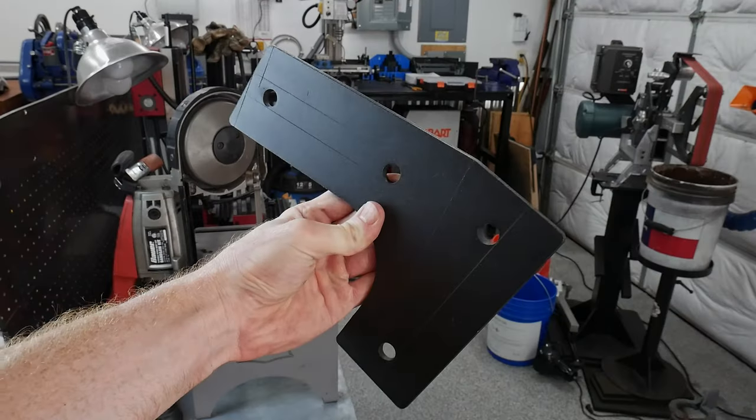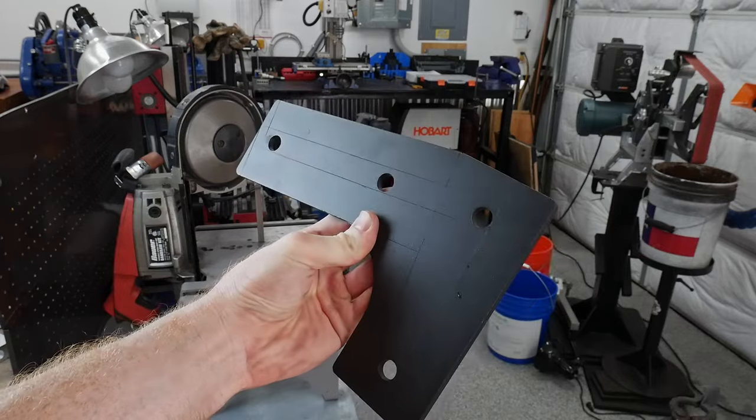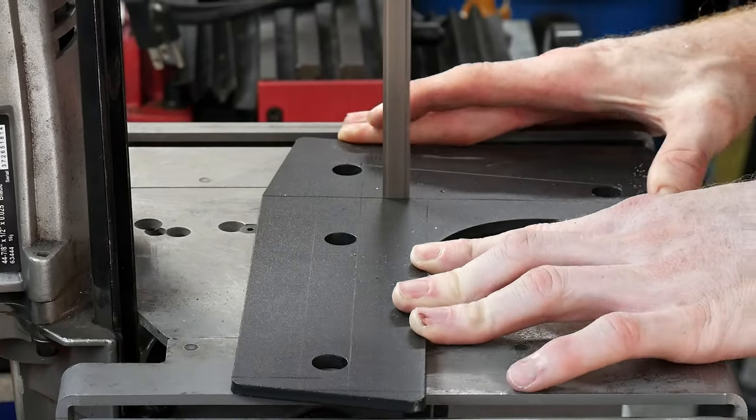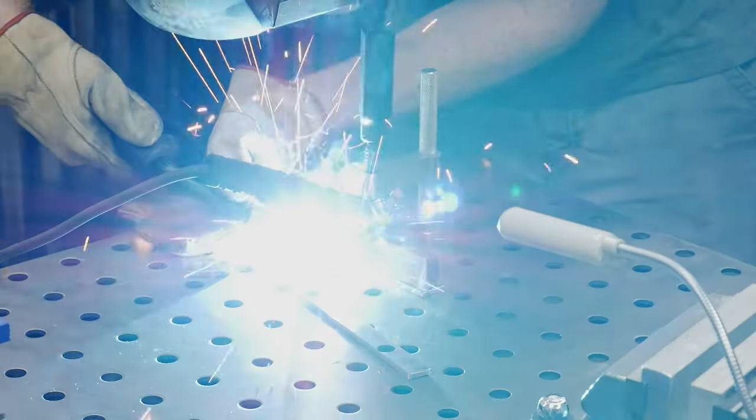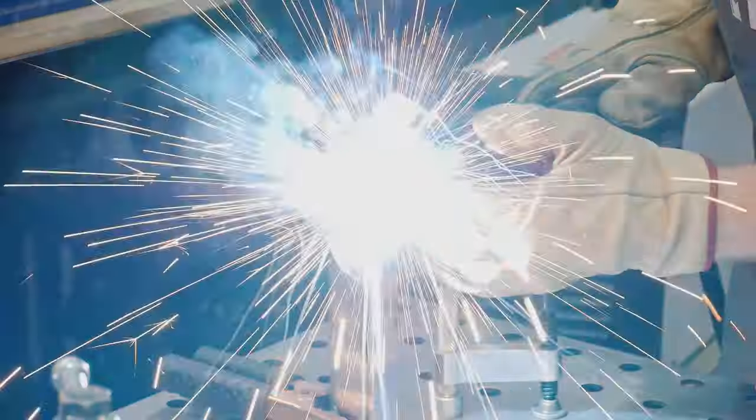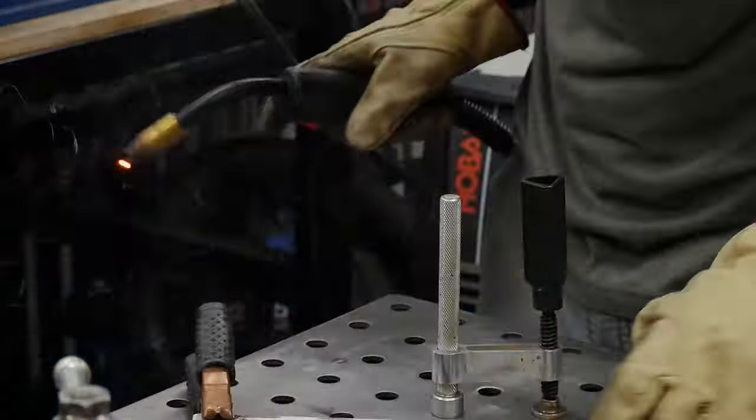When fitting my guards in the past, I have used a crude guard punch made out of an old pipe. I decided to take this piece of scrap steel and upgrade my guard punch. All I did was cut long pieces and welded them together in a rectangle with a cap on the end for clean and square hammer blows.